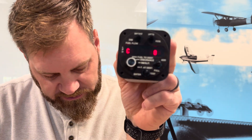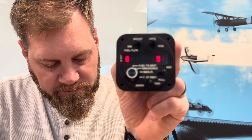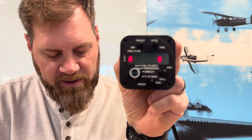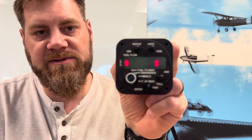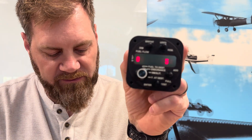The next value is 'O' (or zero) — this is the GPS output type. If you're interfacing the serial output with a Garmin or Avidyne, you can set the output type here. The most common format is 5 — Garmin uses it, Avidyne uses it, pretty much everyone we interface with uses this type. From the factory it's set to 5, and you can use the Add/Full switch to adjust it, but default from the factory is 5.